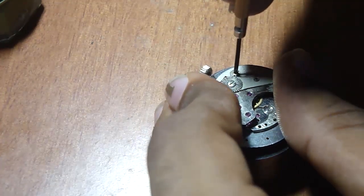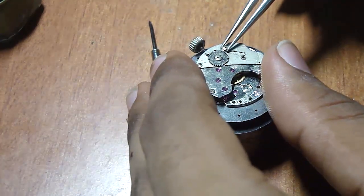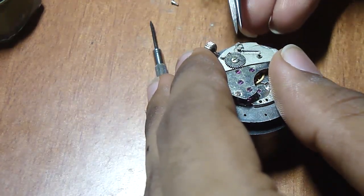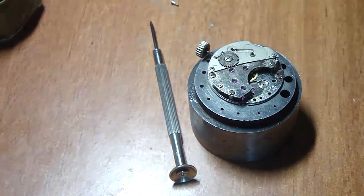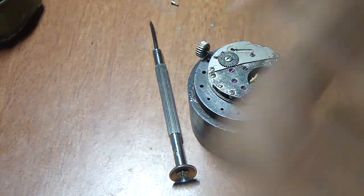There is a screw holding the click in place. I'll just remove it. Now again, it's not necessary to remove the click for a service, but it's my habit to remove almost everything on a service. Now in this watch, the click sits on the crown wheel. The click interacts with the crown wheel, but it's not so with many of the watches where it interacts with the ratchet wheel. So this is the click. To store it separately. And the click spring,